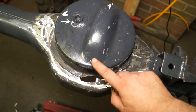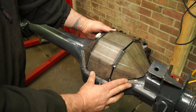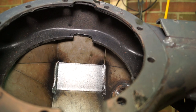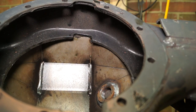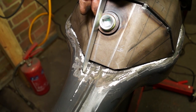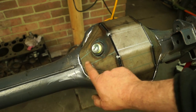The crown wheel has a slot in the banjo, and what we need to do is make sure the new diff pan is not going to hinder the crown wheel whatsoever — this is quite vital. We'll have to fit the diff but I'm just showing you this while we've got it in such a state. The diff pan must not hinder the crown wheel in any way. We're going to weld the seams first and then offer it up and make sure it's right. I've marked out where the bottom oil level would be and it does seem to fall in the right place — marked out properly this time. We need to grind out and take the seam out so we can weld this pan on, but we won't be doing that just yet.